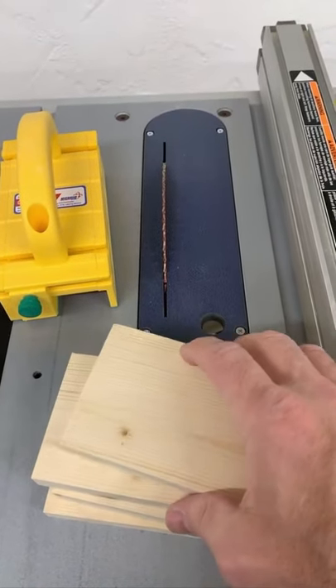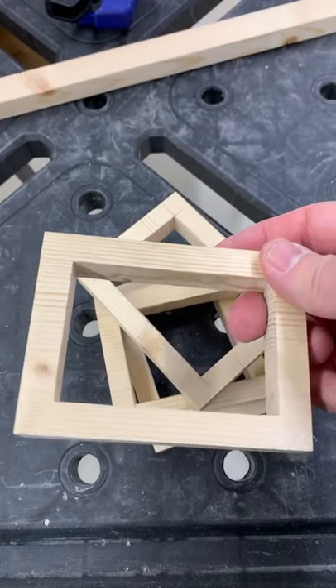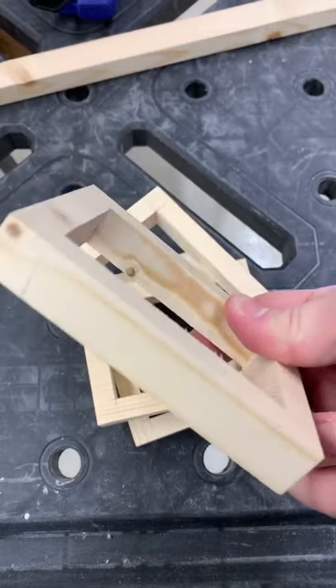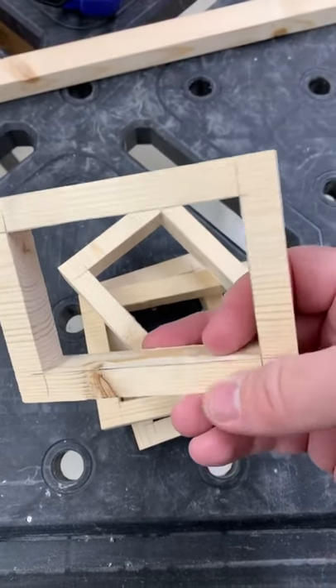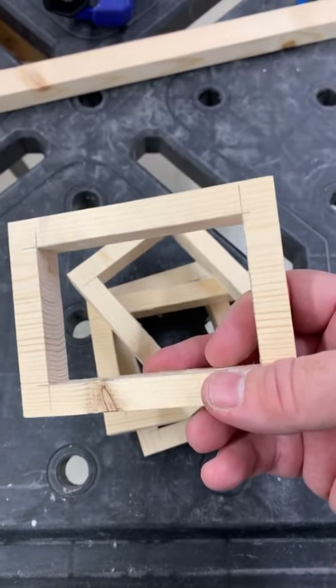I don't know if I'm finishing them today — there's a lot of work involved. I've cut out the frame opening on a solid piece of wood. The next step is to route out the backing so that it can hold the art, the plexiglass, and the backing. So I'm going to do that now.